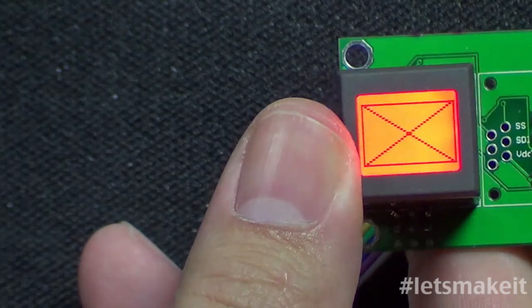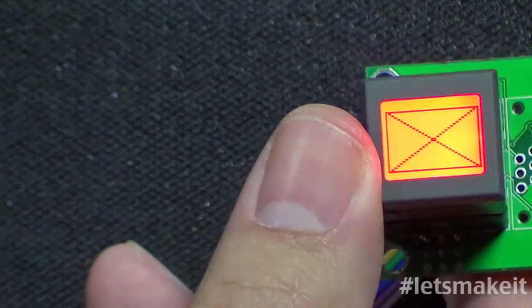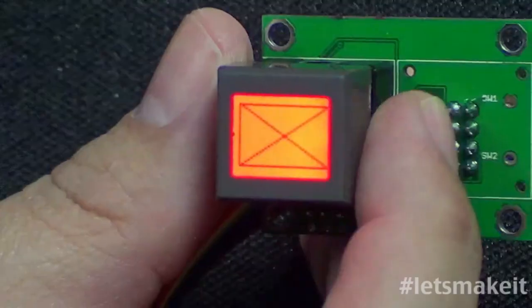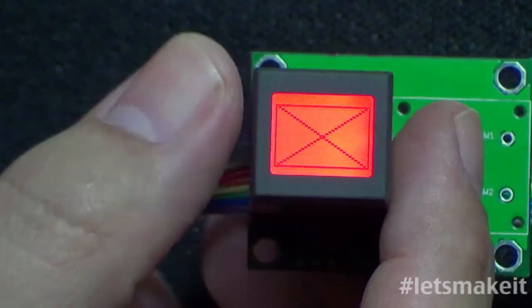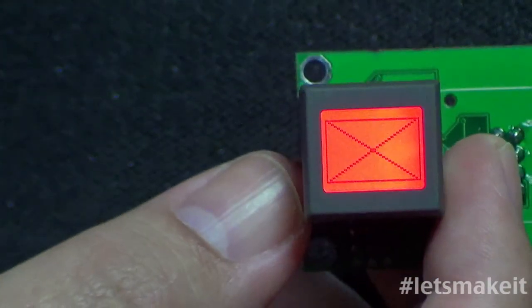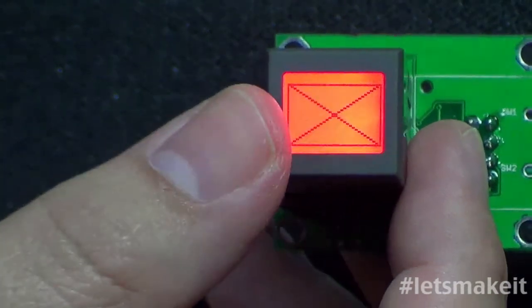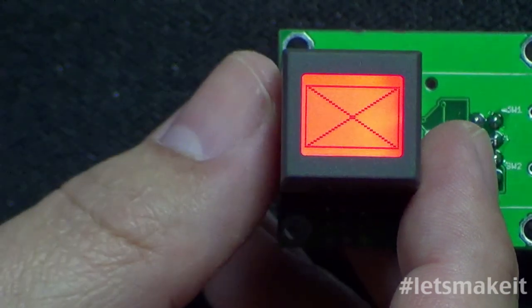So what I'm going to show you is the code that's required to do this. Now, a couple of things about these smart buttons and how they work. The reason we have to have this chip in the back, well, it's 2 reasons really, is the protocol that you use with the ICSP stuff is not specific. It's not addressable. So there's a pin on this smart switch saying switch select. So whenever that is high, it's telling this switch that I'm talking to you. So what we have to do is we tell a pin on that 23017 chip to turn the switch select high on this, and then we send out data down the SPI port. So that's how we know it's talking to it.